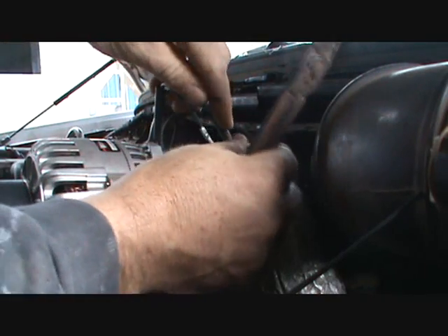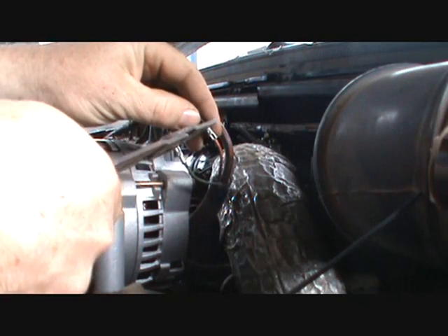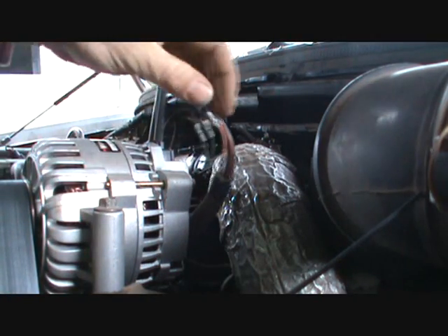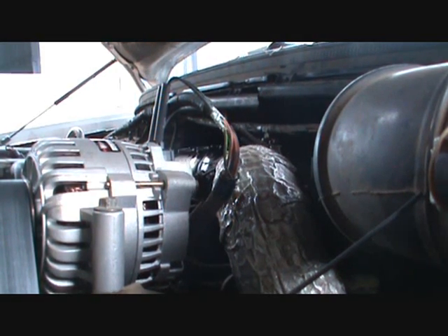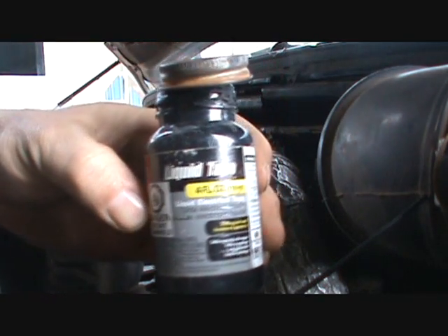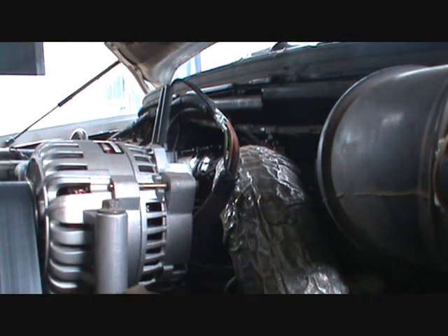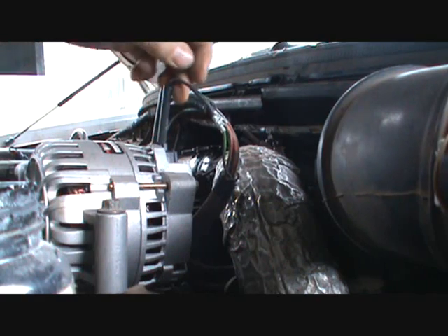As you can see, I'm crimping pretty quickly now. It's all crimped up. I'm going to tape this after I get it all heat sealed. This liquid tape is an R-Peak special — you can get it in different colors too. It works really, really well. What I'm going to do with this center one is just put a little bit of goop over the top of that. That should do away with that problem. Now all I really have to do is slide over my heat shrink. Somebody once told me I was supposed to stick silicone down in there and heat shrink over top of the silicone, but I've since been told not to do that. I don't really know the reason why, but I'm not going to be putting any silicone down in there.